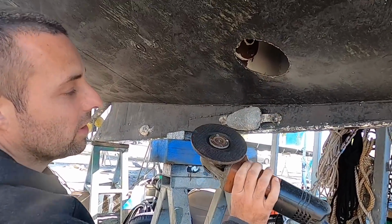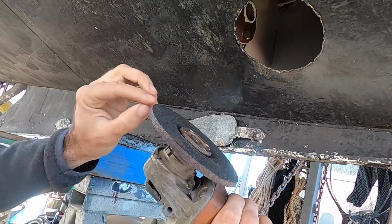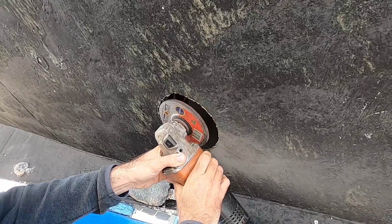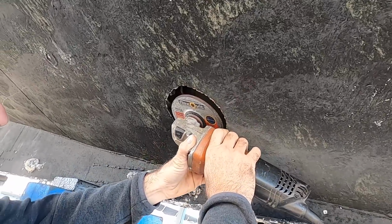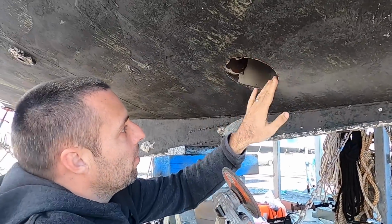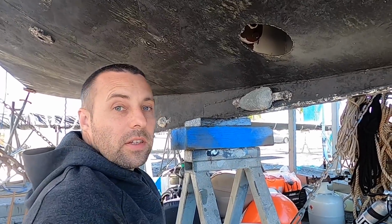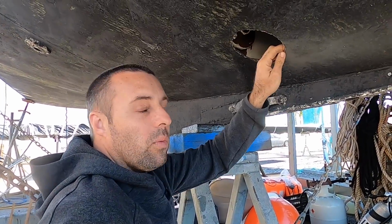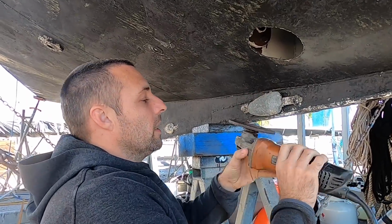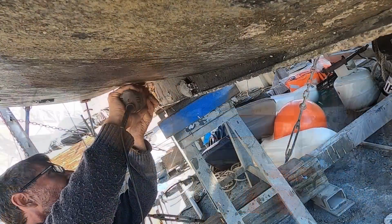A trick that I use is just getting a 6mm grinding disc, a new one, so you've got a nice flat edge on this side, and then you grind by literally holding it as you go around like so. You just grind it around and around, and you end up flattening off all the burrs and all the rubbish that you get from the plasma cutter. It doesn't take long to actually get it to work, but you end up with a way, way better job. Some people are really worried about doing it without a guard, and the easiest way to deal with that is to give it to a friend and just get them to do it.